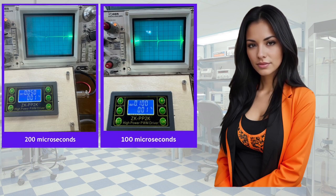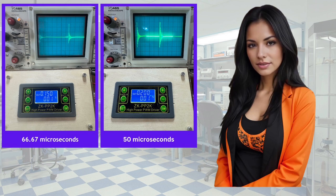The next is 50 Hz, 1%, pulse width 200 microseconds — clearly far from our healing waveform. The second is 100 Hz, 1%, pulse width 100 microseconds. At 100 microseconds, the signal is not as strong because it dampens out quickly, but it is getting closer. As the pulse decreases in width, the signal improves in its dampening time. The next is 150 Hz, 1%, pulse width 66.67 microseconds — the bottom is clipped but we are getting closer. The second is 200 Hz, 1%, pulse width 50 microseconds. Yay! This is the healing waveform.